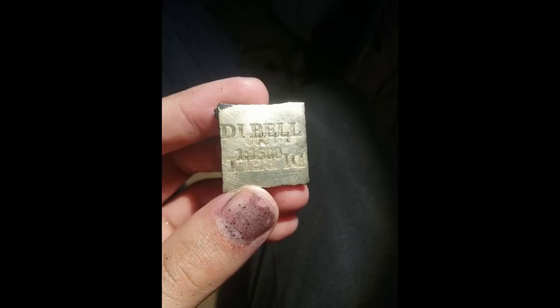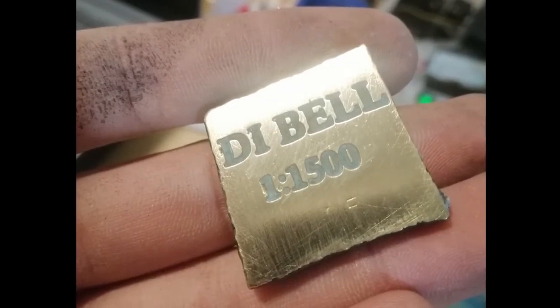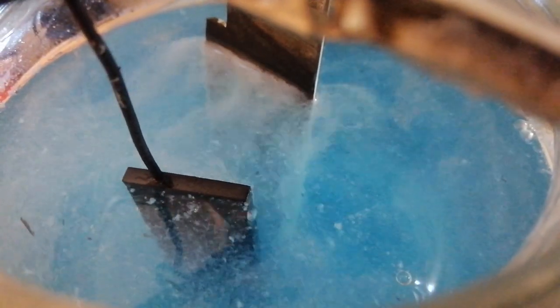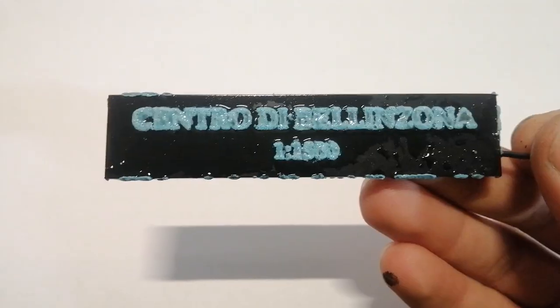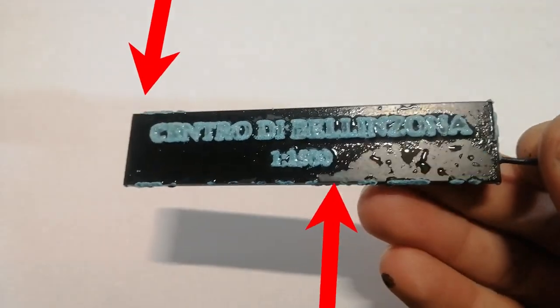I left it in for five minutes because I found that if you do lower currents for longer time the shape would expand and give a bad result. Applying too much current for too little time instead would remove the paint, especially on the sharp edges, which are very prone to this problem.